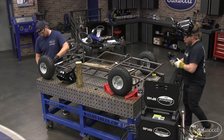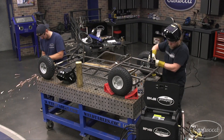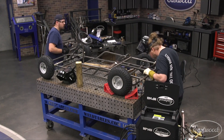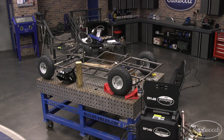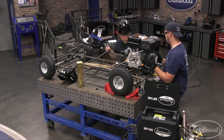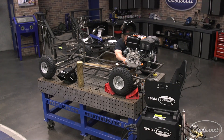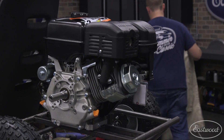Just like we ended up doing the seat mounting, we did the motor mount the same way. We used two one-inch pieces of square stock, notched the ends, and put them from front to back on our actual go-kart frame. This way we're saving weight by not using a big plate, and if we ever need to move the motor front to back, we can just drill new holes. It was a pretty simple design that worked well.